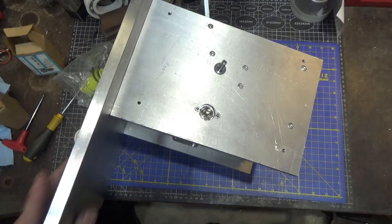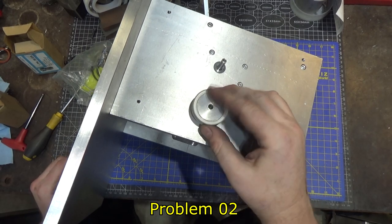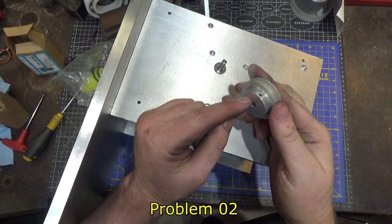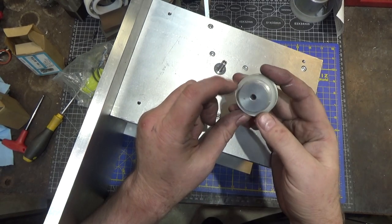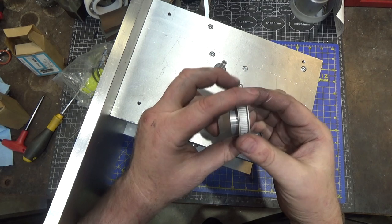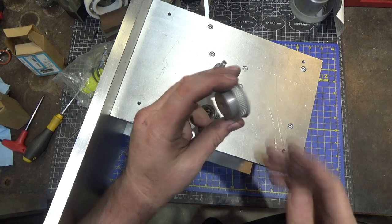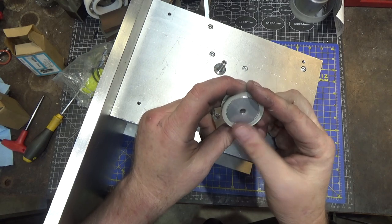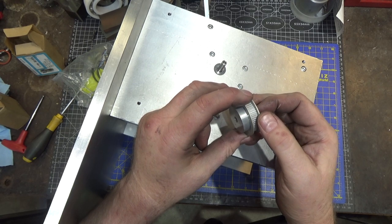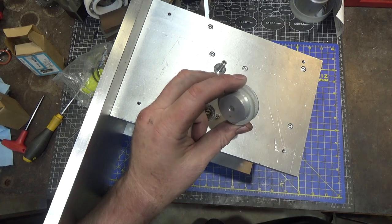Be right back. In addition to reducing the screws, I still don't have much shaft to grab onto. So I am going to have to reduce this center section here, remove the set screws, and reduce that diameter down, which means I'll have to hold this gently in the chuck and try and get this square. Eek. Okay, this is a very delicate part. Turning it down is not going to be super easy. Well, we'll remove these set screws first, and I'll be right back.